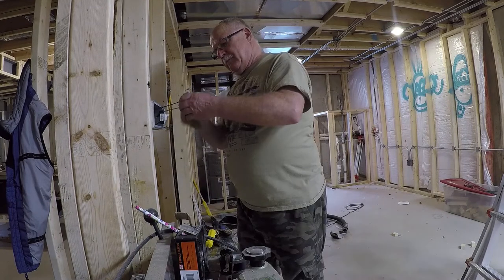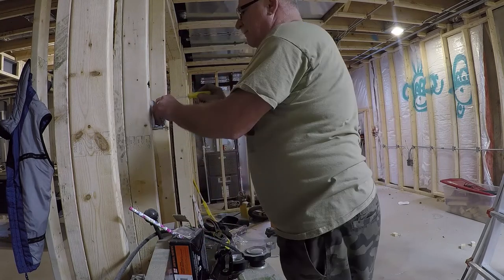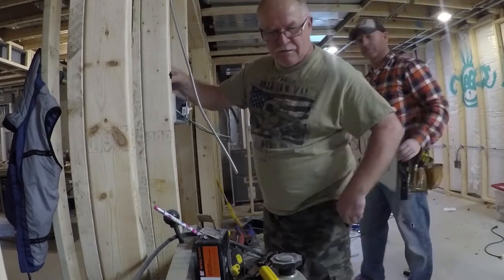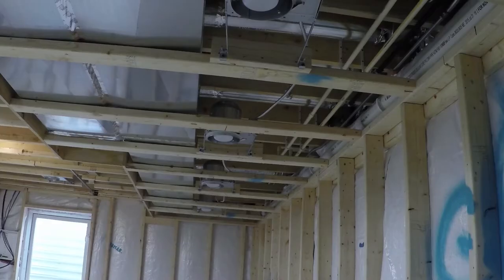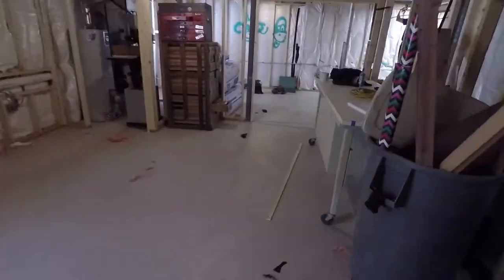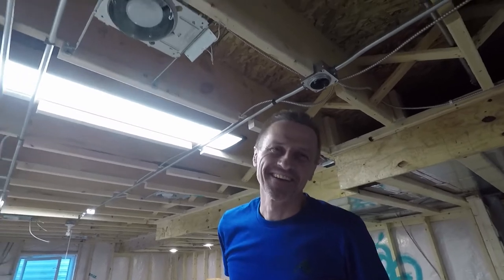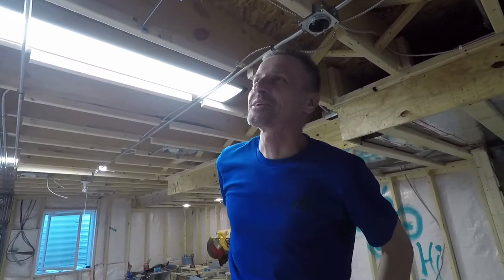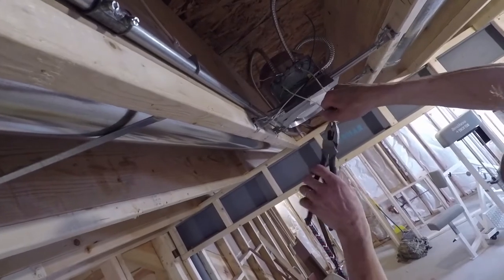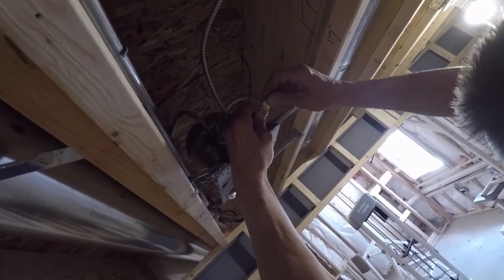This was a treat for me — my old man took the day off from work to come by and give me a hand. As I get older I appreciate the time I spend with him more and more — these days we love spending every minute with him. Plus he's a really good electrician and he wired up a bunch of my lights. The next day I came home from work and my electrician Frank was down in the basement. Frankie wired up the rest of my cans that my dad didn't get to — connecting white to white, black to black, and green if you ran clad wiring. Pretty easy.